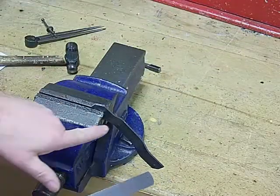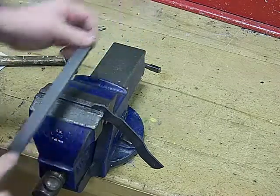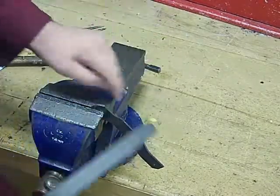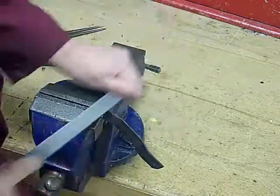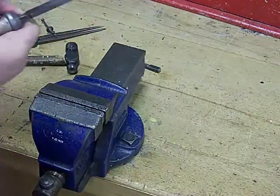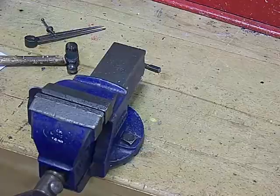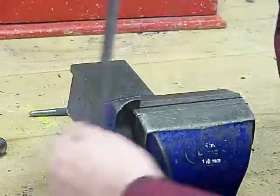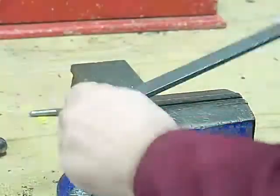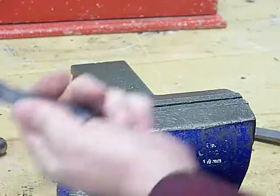Make sure that your work is nice and low on the vise, and make sure the vise is not interfering with the bends. I'm going to file that flat first of all — if you point this file very slightly upwards it will make less noise. File that flat, then file this corner. It's quite distinctly flat; I've not been rocking the file. I've still got the line left, so I'm going to file it down to the line. Put it into the vise this way, and use a scooping action — try to concentrate on the corners, not the flat bit. That first corner, that bit, and that one, then blend it in. So that's one done.